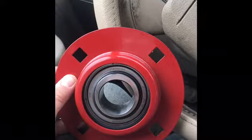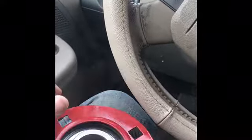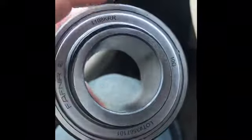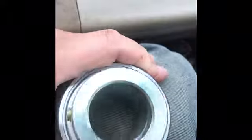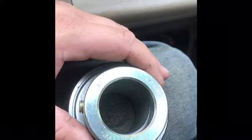So this is the new bearing that's going to go on the chopper shaft for the chopper in the back of the combine. It's been sat out overnight so it's kind of stuck in here at the moment. This is the bearing, and as you can tell, the outside looks a little oblong — it's thicker on the bottom side here towards my thumb, and the metal is thinner right up here. What that is for is to allow this retaining pin to go on properly. You just line this hole up — you see how it swivels? It's thicker here, but if you get it in the right position, it's locked in there tight. So that's going to keep that shaft centered and locked in properly.